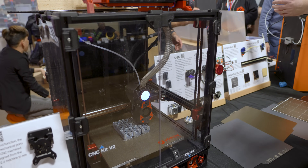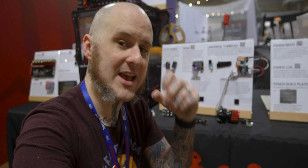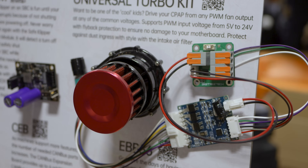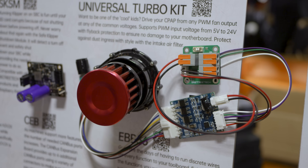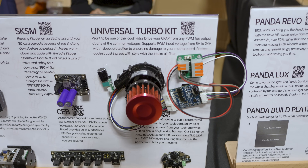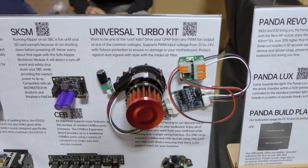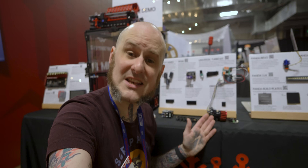Where we might want to adjust fan for overhangs versus your regular layer printing. So now they have an add-on board that comes with this turbo fan setup that allows you to just connect it to your standard fan port connection on your main board of your machine — probably from BigTree Tech — and that will allow you to control the fan directly from your interface, your firmware, and not have to have some additional hardware control. There are traditionally ways of doing this via the GPIO pins on your Raspberry Pi, but this is going to be so much simpler and easier to control from G-code, without having to create some custom macros just to adjust your fan speed.